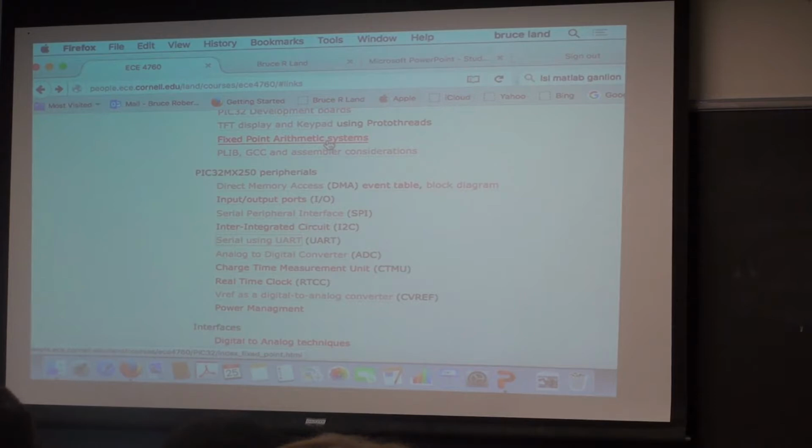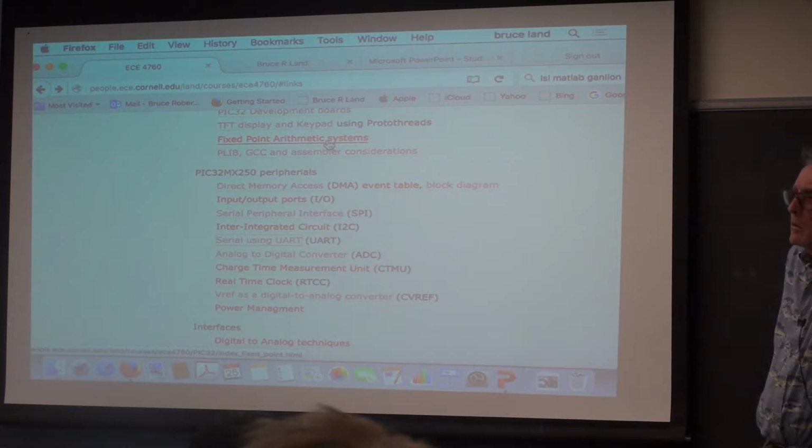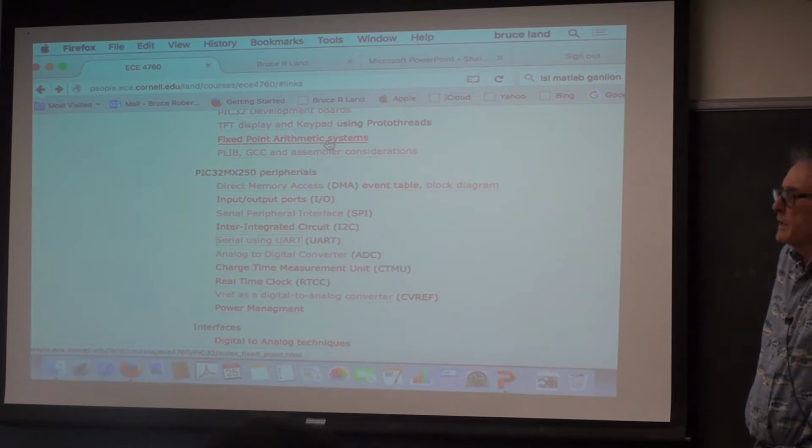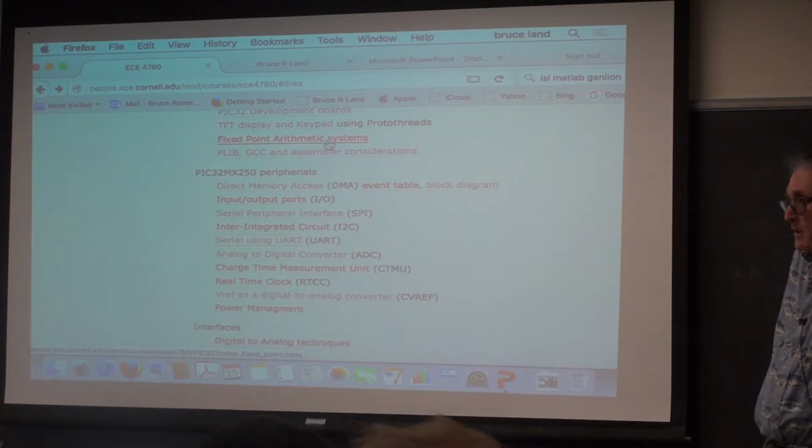Mostly working? Yeah? Just one last lingering question for recovery error. What's your thoughts on whether to use ADC units or degree units? Because it seems like degree units has 1/3 of the resolution but less noise. If you use integer arithmetic, then it makes sense to use ADC units because then everything is in integers that you can represent. If you use degrees, then you almost have to use floating point.